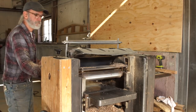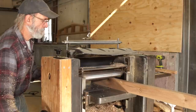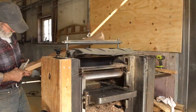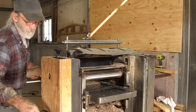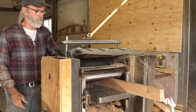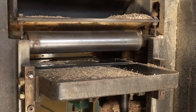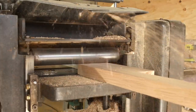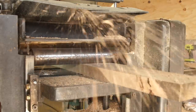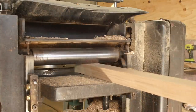Something I've done for years that I haven't seen anybody else really do: I put the piece of wood in the planer first, then I crank it up until it starts to plane. It's not going to plane the full length because it's halfway through already, but once it planes the tail end of it, I just pick it back up and send it through again and it comes out consistent. I've cleaned them all on edge, and I'm going to do exactly the same thing in thickness - lay them down on the side, crank the planer up a little bit until it touches it, run it through, measure it, adjust it, and plane the thickness.